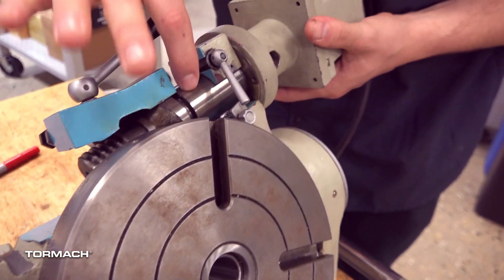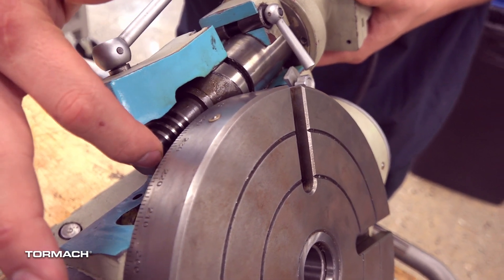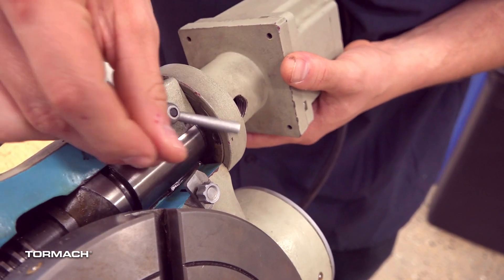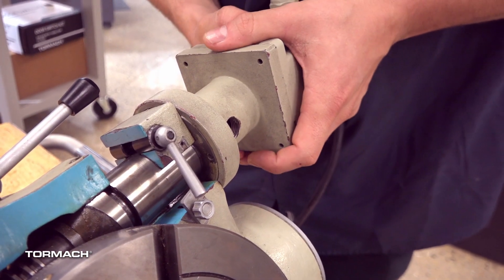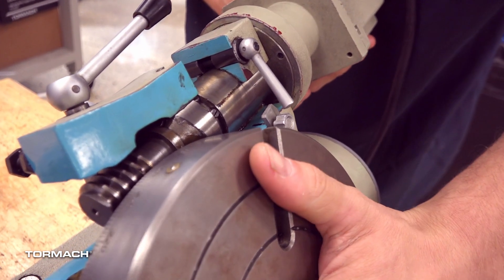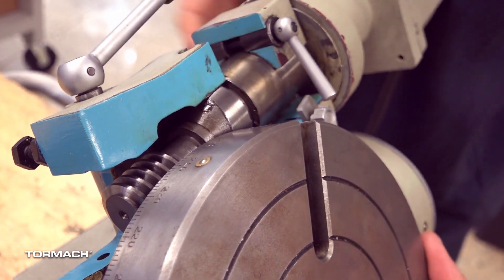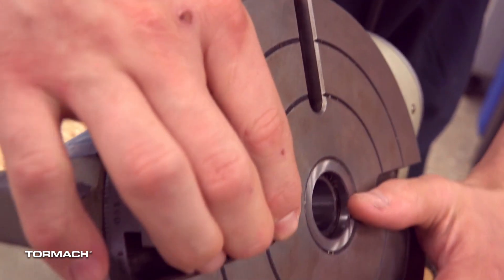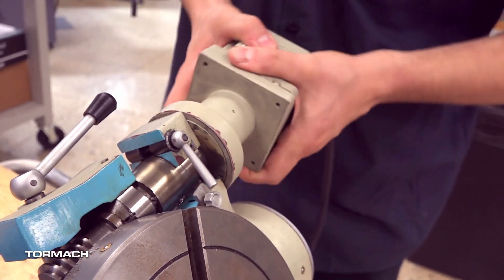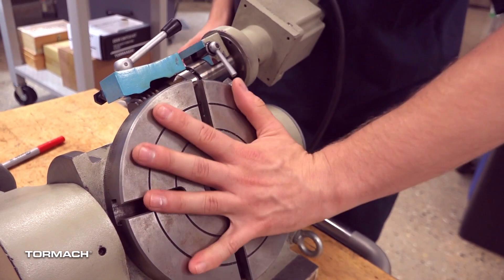The motor is on an eccentric that rotates the gear and the worm together. This is your lock — if I lock that, I cannot rotate it. If I unlock it, you can see it'll rotate into the gear. As you can see, I cannot move my faceplate anymore; it's locked into place because I would have to overcome the power of the motor. When I rotate this back out of the gear completely, I can freely spin the faceplate.